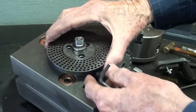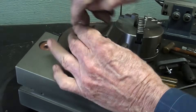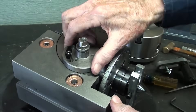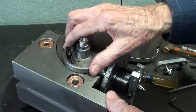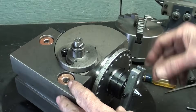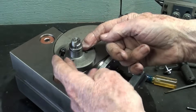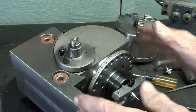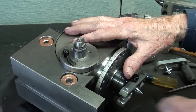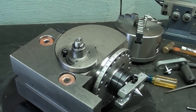Right now I'm going to take the crank, plate, and sector off so I can disconnect the worm and worm gear to do direct indexing. It's a bit of a pain to take it all off. There's an Allen screw right there — loosen that up and it allows me to swivel and disengage the worm from the worm wheel. With the screw loosened and this rotated counterclockwise as far as it goes, the spindle is now totally free. Also, this adjustment allows you to take up wear between the worm and worm wheel, and there's oil down in here as well — almost like a little crankcase.